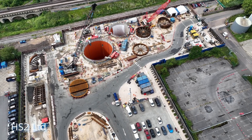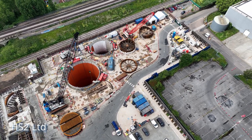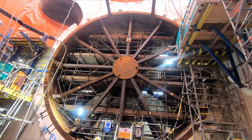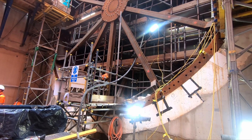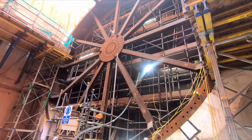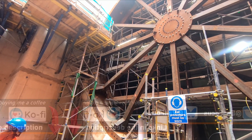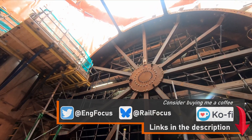The rings you can see here in this shot are the shutter pipes, which will be lowered into the shafts and then surrounded by concrete. They are the same as the ones in this shot, which have already been inserted into the main shaft. The ones at the surface are waiting to be lowered into the satellite shaft. The spokes that you can see attached to the pipe are only temporary, and are used to keep the shape of the pipe whilst it's being lowered and during the pouring of the concrete around the ring.